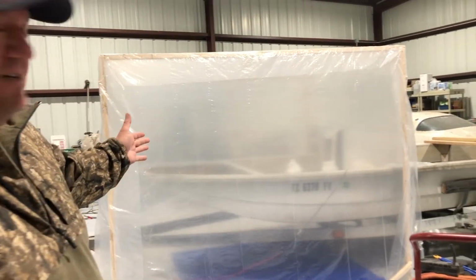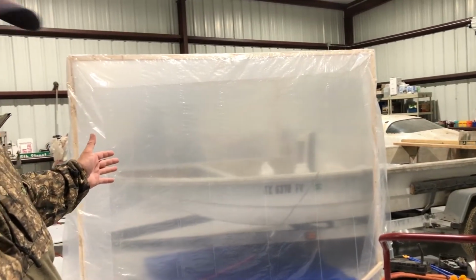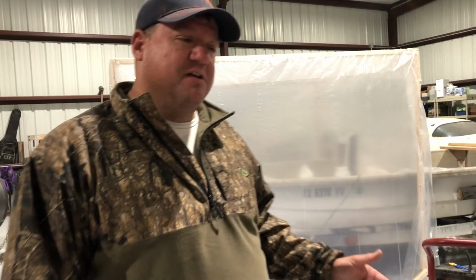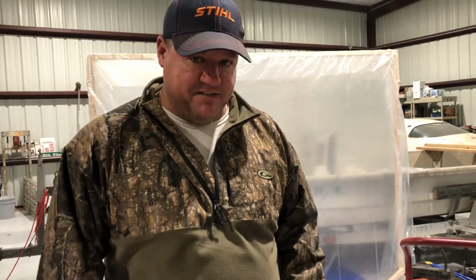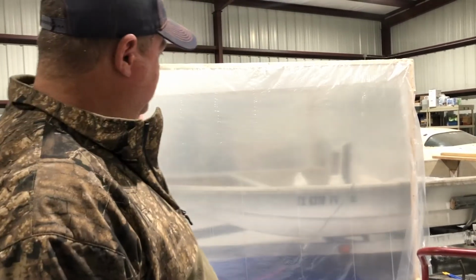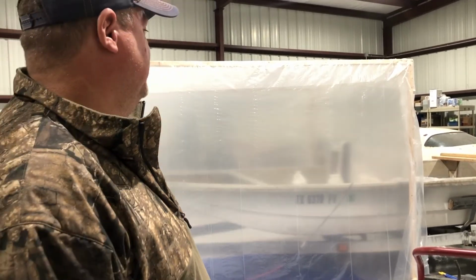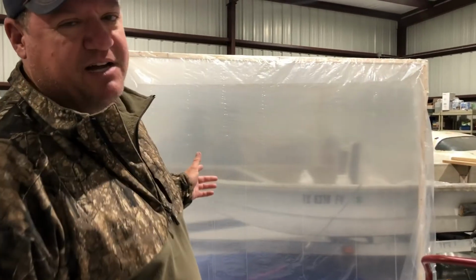Today's video number 3. What we're doing is we had to build a hooch behind us, and what I mean by a hooch is we had to enclose the area of the boat that we're working on. We needed some heat. It's in Texas now, we're about 43, and I know a lot of places is a lot colder, but if you know the chemistry of fiberglass, anything below 70 degrees it does not like to set up. So what we do is we cheat. We build a hooch with 2x2 furring strips, put plastic over it, and if you come around, I'll let you peek inside. You can see how we get heat.